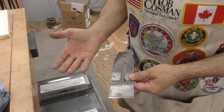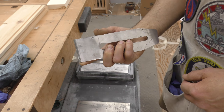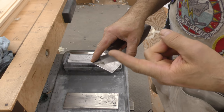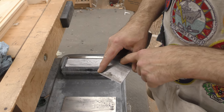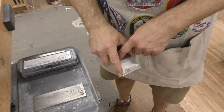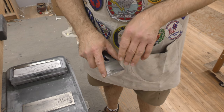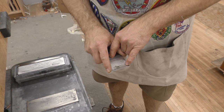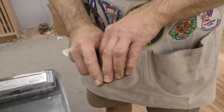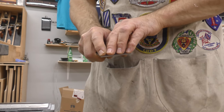Here's how I choose to hold it. With my right hand, my index finger and my fingers are just kind of falling into that groove in the middle, index finger on the far point. I take my left index finger and I put it in the hole and that kind of becomes my indexing point. I'm on a bit of an angle. I want to have as many fingers along that cutting edge as possible to evenly disperse the pressure — pinky, ring finger, middle finger — and I bring the index finger of my right hand around so that I now have all four fingers lined up right on the front.